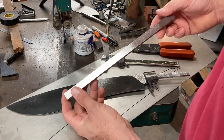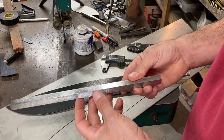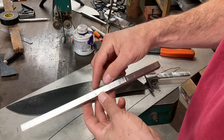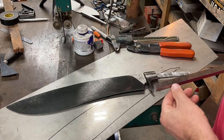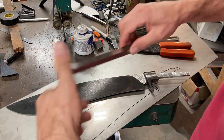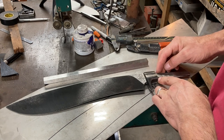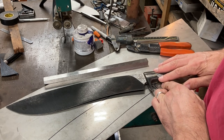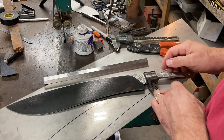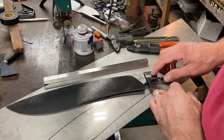We've got this stock here — this is the other side of the bar we ripped to make the edge, so this has the spiky 12-layer W's in it. And we are going to forge the handle frame out of this. That's going to wrap around the butt of the tang here and be shaped to the profile of the handle. We're going to make that fit tight to the tang in front, and then we're going to see about a strategy for locating pins to make it repeatably indexed to the back of the guard so it can't shift when the knife is assembled. So we've got a lot to work on — first thing we're going to do is just measure the scales, think about the guard thickness, and go from there.